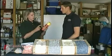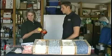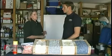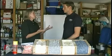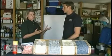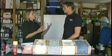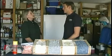If your holes are not too large, you can use the expanding foam to take care of those problems. If you have something like a chimney chase that you have to address, then you would need to get aluminum flashing, and you'd have to buy a high temperature silicone caulk. So there are different applications for different things that you might have going on up in your attic. And people can call us if they have questions on how to address some of those things too. Absolutely.